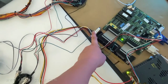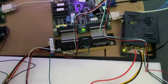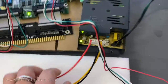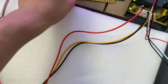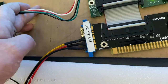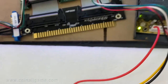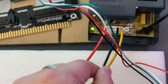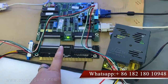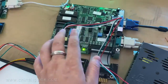This is the power for the master boards. This is the master board and this cable comes from the power supply — the red cable. You see: one, two, three — the fourth one is the red cable. There are five boards here. The black cable is the ground, and the yellow one is the 12V. So three cables connect here to supply power to the master board.